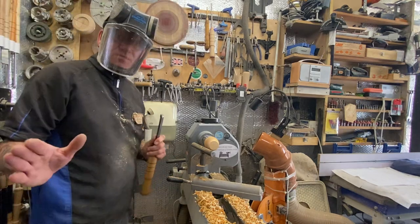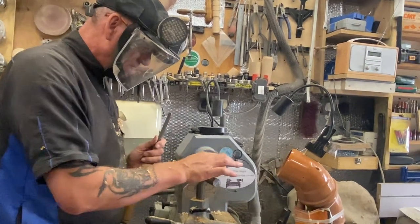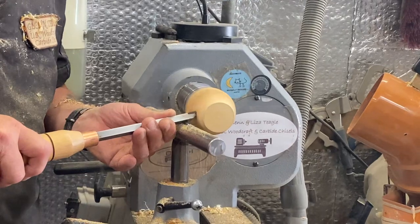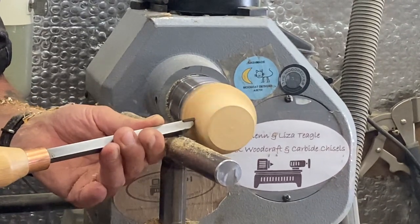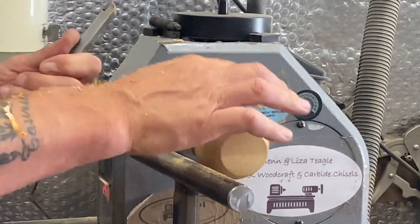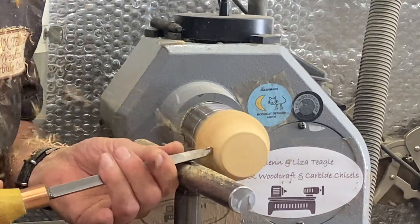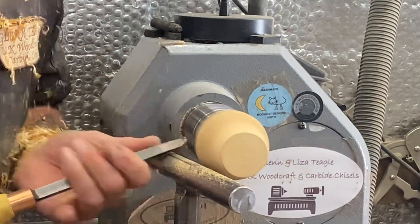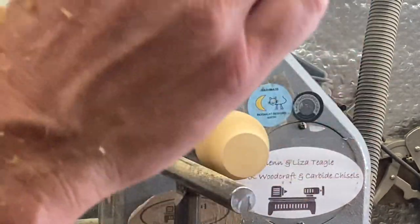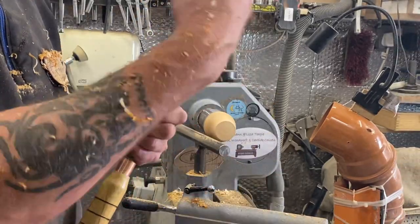You might get away with it, but one time it might just go bang and grab you. But you can come round and roll it, a bit like a skew. If you can get that angle, it's alright, because it's going uphill there. There's a rough bit there, it's still not round. See, and did you see exactly there? That's not round there, it's got a flat spot, and what it's wanting to do is grab it and peel it off.